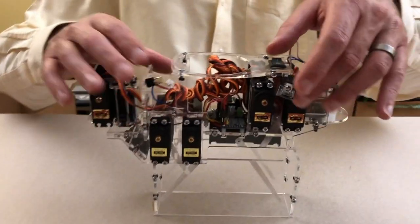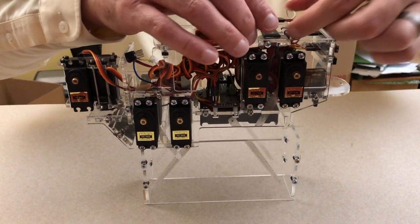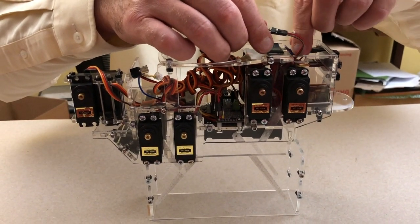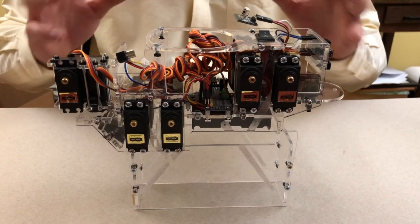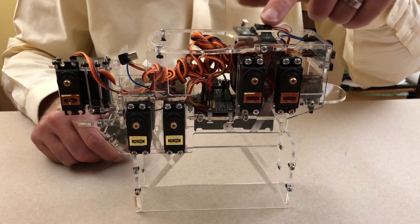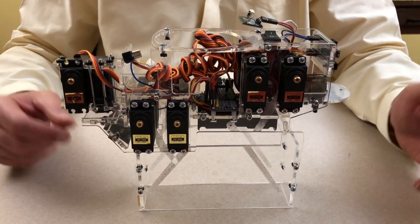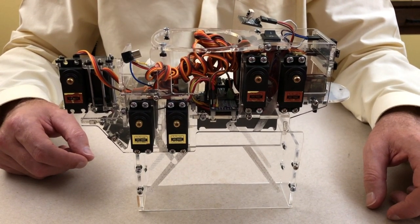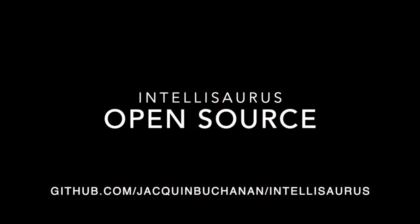Alright, so this is as much wiring together as I'm going to do right now. I've got the infrared sensor just sitting here for now. The next thing we will do is power it up and give it a test. I suggest you run through this whole thing one more time — make sure all of your 5 volt lines are connected to the right spot. If you've got that reversed on any of these sensors, the sensor is going to get ruined, or your Arduino could be ruined, or one of the boards could be ruined. So double check particularly the 5 volt and ground lines on all your connections before you supply power. That's the first thing we'll do in the next video. Let's go.